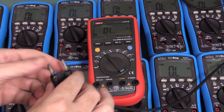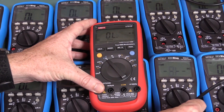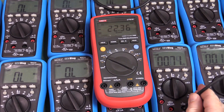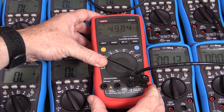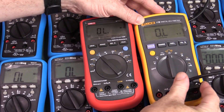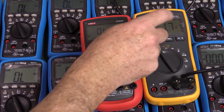Just for kicks for all you UNI-T fanboys out there, I'll try my UT61E - 49.84K. Not that terrific. Is it within spec? 0.32% - yeah, I think it probably is just within spec. And that same 50 millivolt range - I might have drifted 0.1 millivolts, we're a little bit low there, but still within spec. A sample size of 1. And I would show you my Fluke 17B, but it has failed - it does nothing, doesn't even read the millivolts. It's dead, maybe a repair video. And there's the older Brymen BM257 - half a digit up. And of course the venerable Fluke 87 is bang on. Here's another UNI-T - not too good at all, but well within the quoted spec.